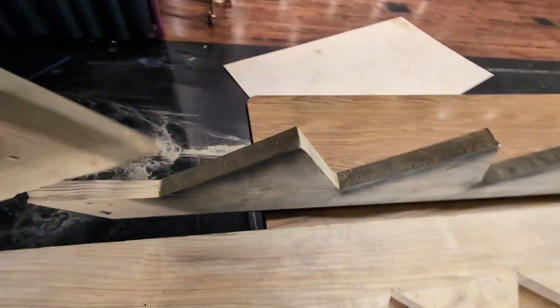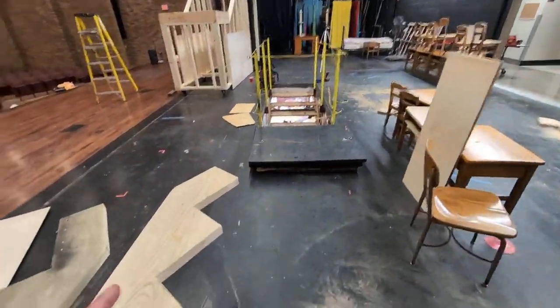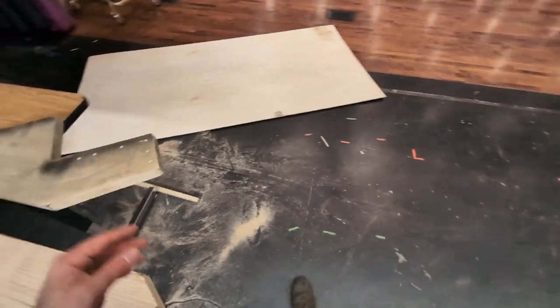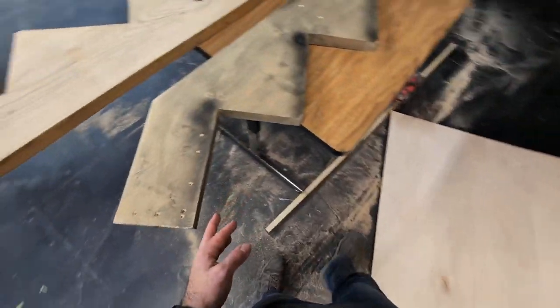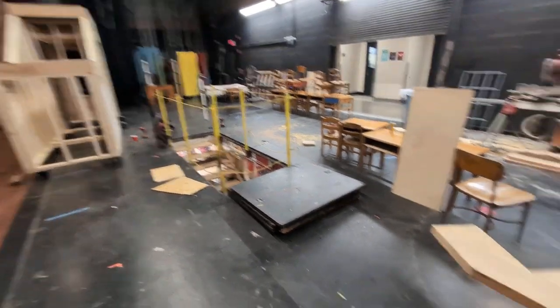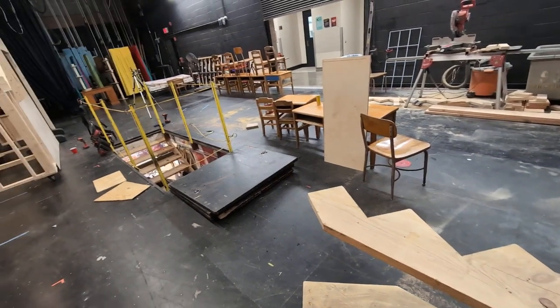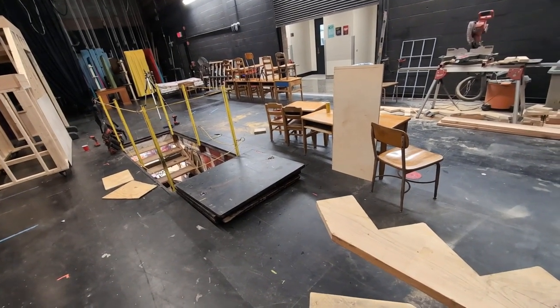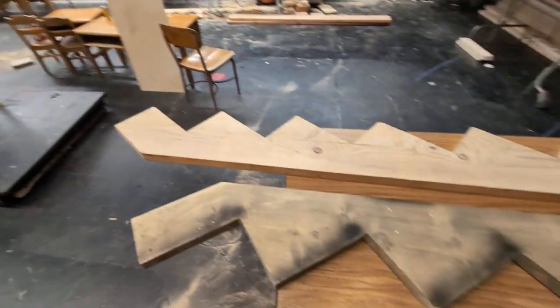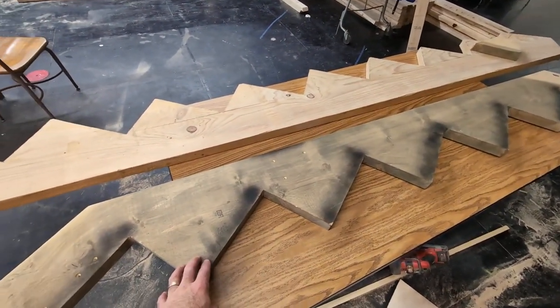And the thing is, this one's already damaged. So I am going to cut this and set it up there and see what the major problem may be. There may be an unequal step situation, slightly shorter or slightly taller from one landing to the other. But in the scheme of things, using these up is going to save me a lot of time. I can always throw them in there and use them for a little bit while we rough this thing out. And if it really becomes a problem, I can quickly make a new fresh set that's exactly right. But this here is really damn close.